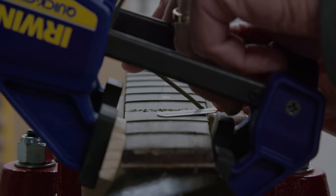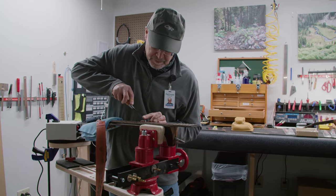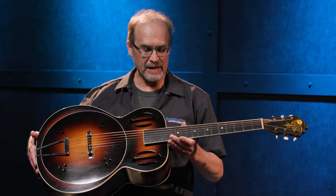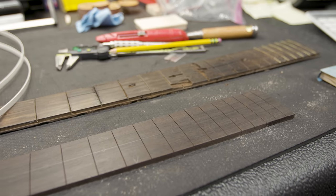So at that point we decided to go ahead and replace the fingerboard. This is a brand new piece of ebony — this is an upgrade for this guitar. However, the mother of pearl dots are the originals, so I tried to save as much of the original as possible. This end of the fingerboard is thicker than normal because it hangs free — it's an extension. I couldn't find a piece of ebony that thick already slotted, so I took a second piece of ebony, thinned it down to 50 thousandths of an inch, and attached that to the bottom of the fingerboard for the support we needed.